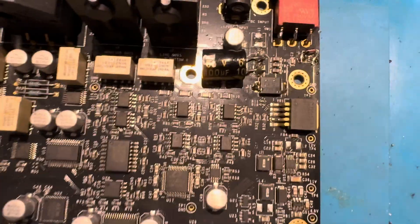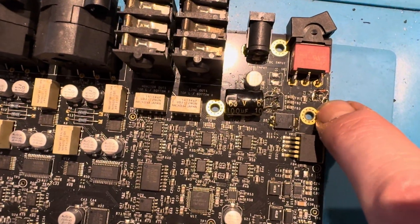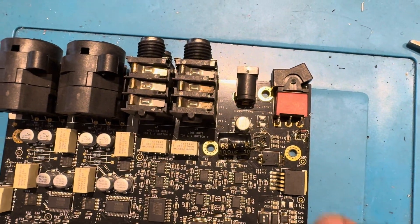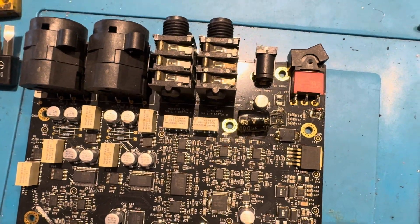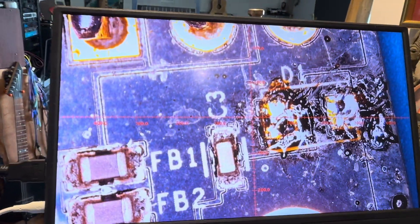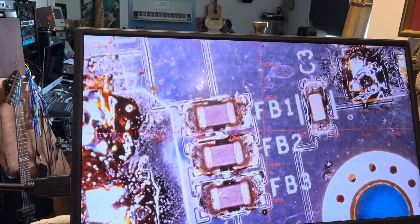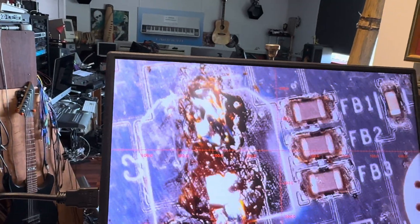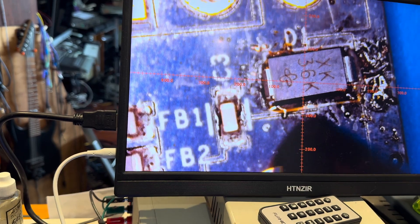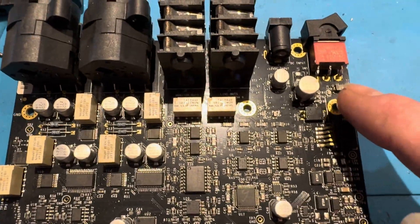So I'm going to open up the satellite, put this in circuit, solder it in, and also replace the capacitor at the same time. So that's what it is — TVS, transient voltage suppressor. Now open — these are the parts I'm going to replace: a proper 100 microfarad surface mount capacitor, and this is where the TVS needs to go. It doesn't matter which direction because it's bidirectional. I'll pull that out, put some fresh paste on, put the new component on. Here's the board under my microscope — I'll put some flux on it, put the component on, and next to it you see the pads for the big capacitor which I'll also put on at the same time. They're in place — capacitor and transient voltage suppressor — let's put it back together.